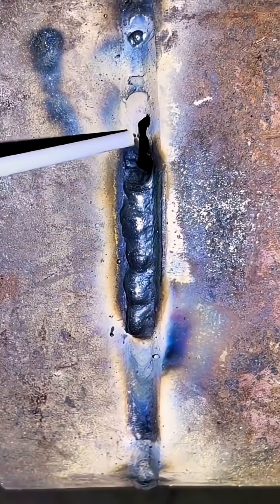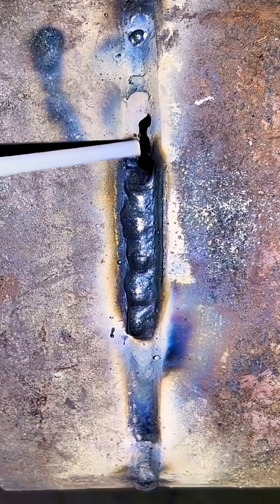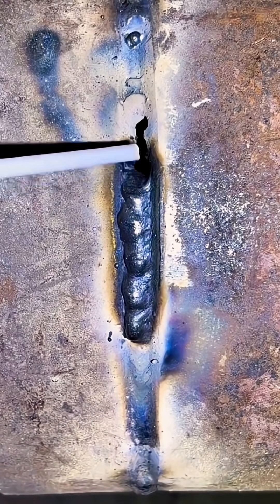This is one method. Keep in mind: once you knock off the flux from a welding rod, for larger welds treat it like scabbing with the rod, and for smaller welds treat it like feeding filler with the rod. If you don't want to use this trick, there's another way — just tap, strike point by point, taking advantage of the high temperature to fill. But be careful: with basic coated alkaline electrodes, tapping is harder because they stick more easily.